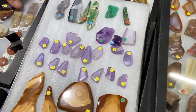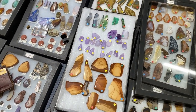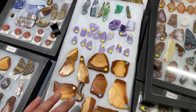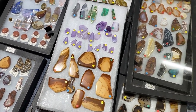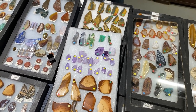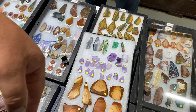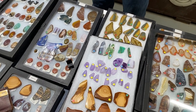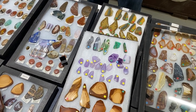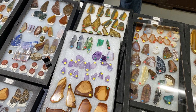I'm going to make pendants out of these. I got a really nice water drill, a Gunther water swivel. I'll drill this thing in 2 seconds. Oh, really? What kind of drill? I'll show you here in a second. Drilling a hole is like butter. But here's the problem. Is it ultrasonic? No. It's a chuck that goes in the chuck of a drill press with a proprietary German drill bit. It squirts water through it. You only get about 600 holes out of it, but I think it pays for itself. The bit's $35, which is a little pricey, but you make your money back on 600 holes. How big a hole? Any size you want. They'll do up to half millimeter, which is the most difficult to do.